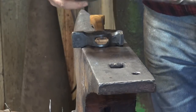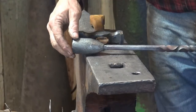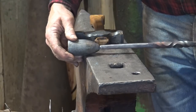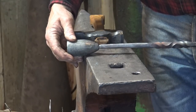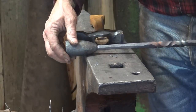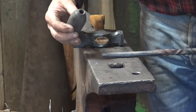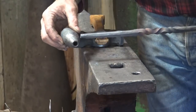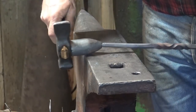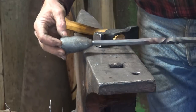There are several ways we can attach this. In a perfect world we'd forge weld that, but this is a difficult forge weld — we'd end up crushing this transition in the pipe, and I just don't think that's the best way in this situation. You could braze it, but I don't want to see the braze material. You can braze in the forge fire, and someday we'll cover that as a video. You could make this a tighter fit, thread it, and screw it together. I think what I'm going to do is weld it — you can weld this any way you're comfortable welding.